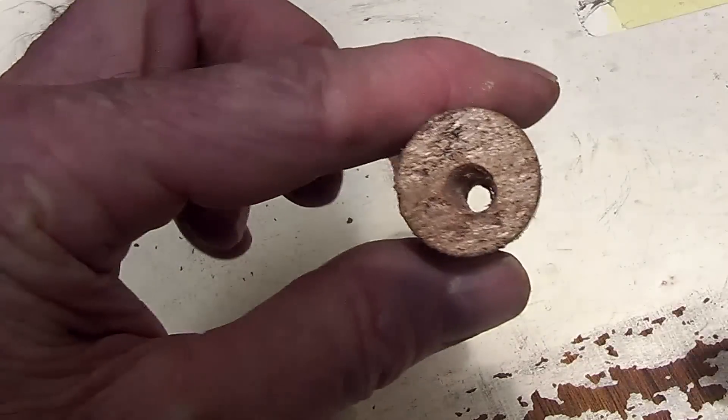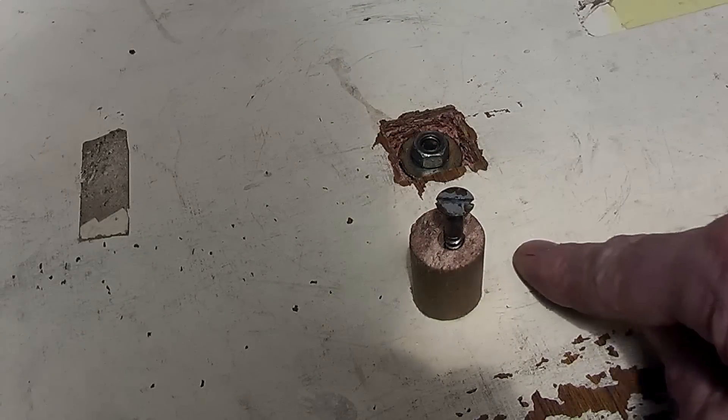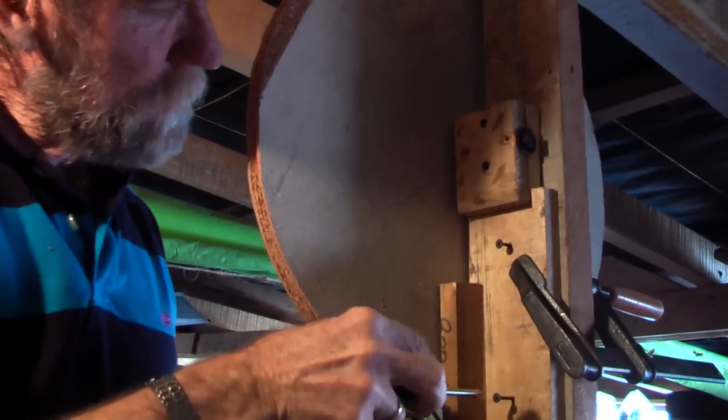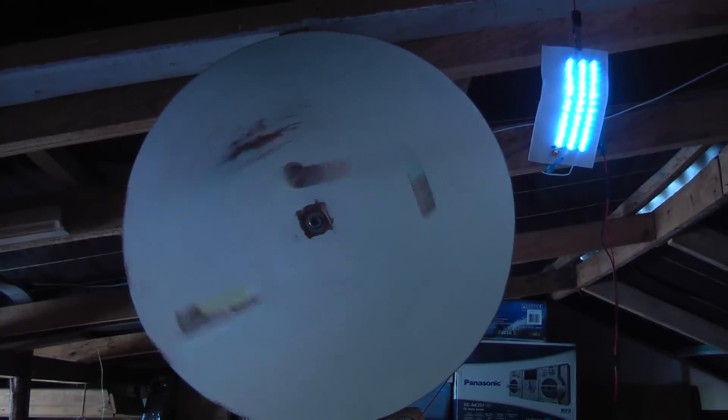The other thing is to take a little piece of broomstick with a hole down the center, a screw for a little handle, and then screw it there. It doesn't have to be too far out actually, because it doesn't take a lot of strength to turn it. Last of all, in my attic I am going to screw it to an upright with a couple of screws. I connect my motor down to some wires up to 50 LEDs, and there we have enough light to at least get around the attic. So there you have it — enough light to get around my attic in the middle of the night. Not too bad. Pretty functional. But the trouble is that you have to keep on cranking it, so the next step is to store some of that energy so you can give it a bit of a crank and then have a little bit of time in the attic before getting back to cranking it again. Next video, we will look at that.